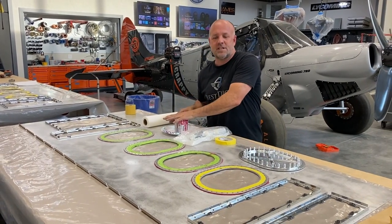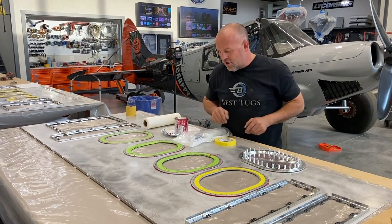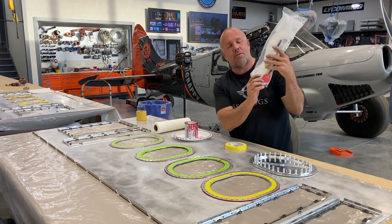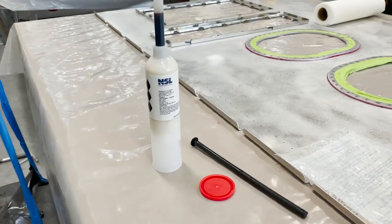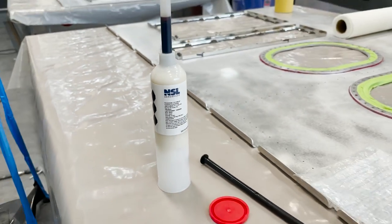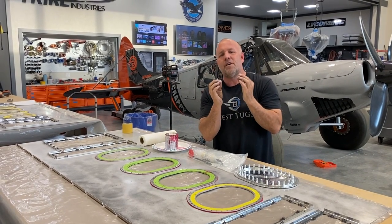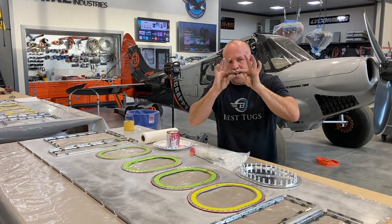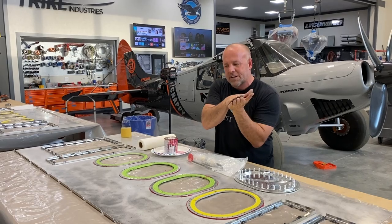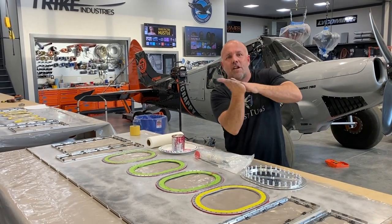It's a much thinner viscosity and I always like to use this between aluminum. You could use some of the thicker paste, which I actually prefer for other areas, but I'll use both. But this stays thin enough that I can baste both sides, put it together, put Clecos in it, push it, and it's thin enough viscosity that it will run out and give you a perfect seam. So when I feel the underside of this, it's still perfectly flush.